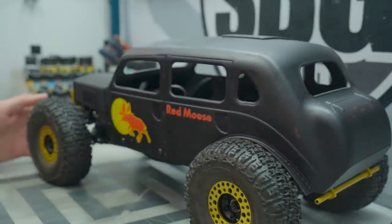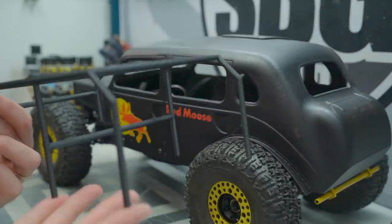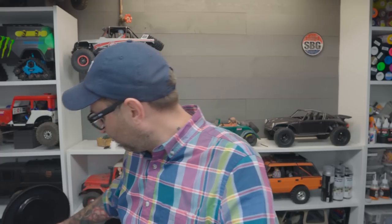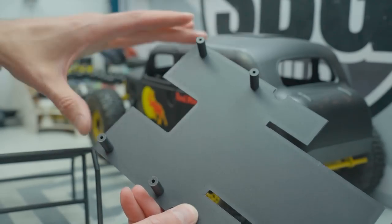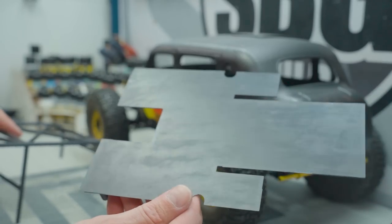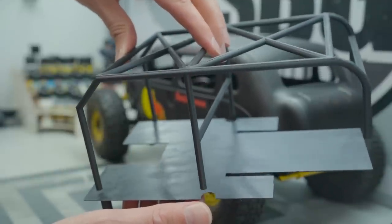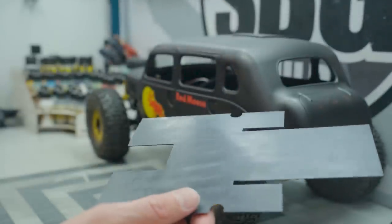I had already printed the cage last time — I made a slight revision, just making it a tiny bit shorter overall because there is a floor that this is all going to be attached to. While it's not the final floor — I'm pulling it out of the garbage — this is the start of the floor. There are some mounting points on the bottom that line up perfectly with my slider design, so I can screw in from the bottom to keep everything nice and rigid. The cage will mount to this, and I've already started working on the next round of revisions on this floor, so there will be holes for all of these things so I can screw this cage in.